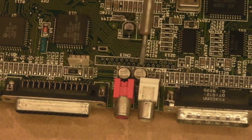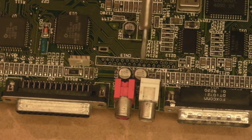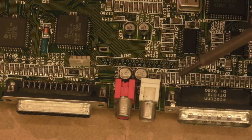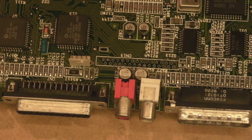Yeah, with very dull solders around that side of them capacitors, so that has definitely leaked, and it spreads, it's around here as well. So we are going to have to do a fair bit of cleanup in this area. It's going to be quite inevitable, unfortunately.